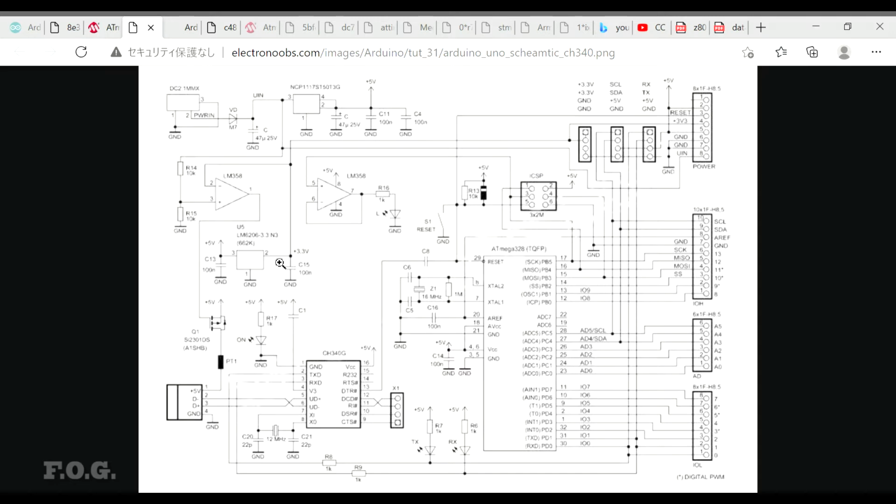And I've looked at this circuit diagram a couple of times, and maybe I'm not looking close enough, but I actually don't see on this board where the 3.3 volts is actually used for anything practical. It looks like it is an accessory voltage or something that can be used externally if you're using a 3.3 volt device. So if that's incorrect, I'm sure somebody will comment on that.